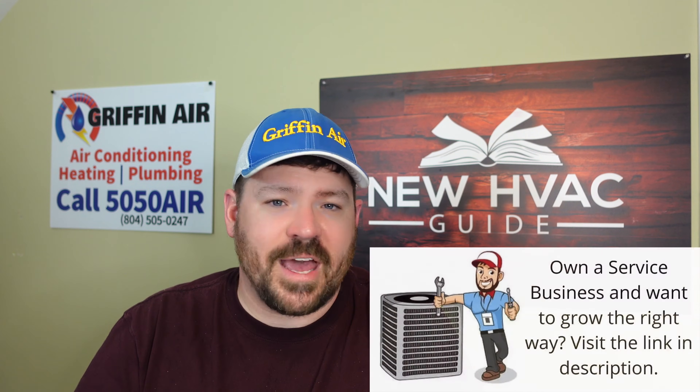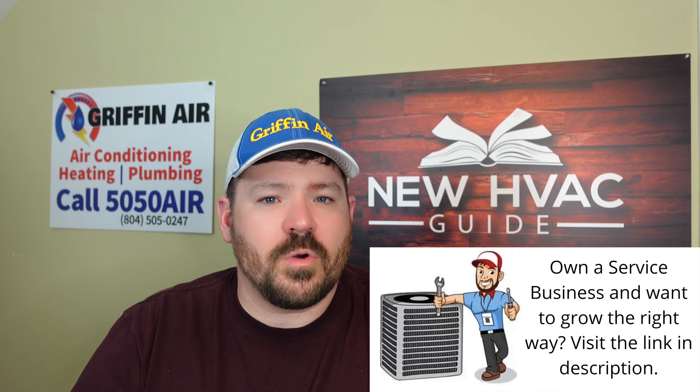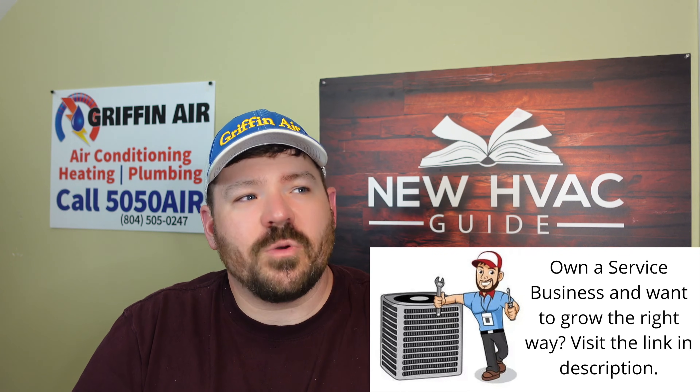The problem is a lot of homeowners don't know that that's what that is. They'll call us and say, 'I think something's wrong with my AC because I don't see water coming from that pipe sticking out of the soffit right above my kitchen window anymore.' And of course my response is: you're not supposed to see water coming out of that pipe. If you do, that means something else is wrong — something has happened — and that water is coming from your secondary drain pan.